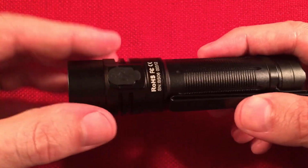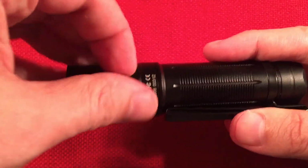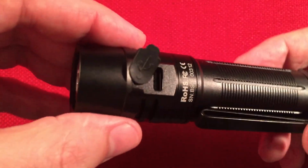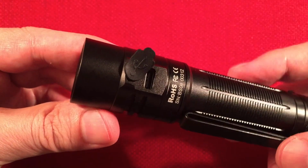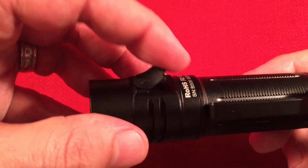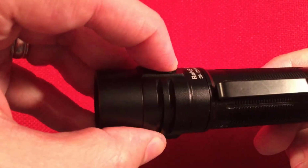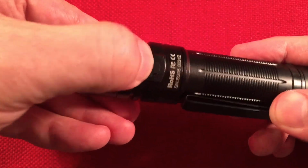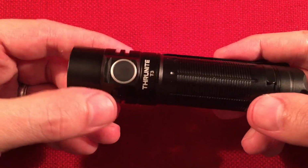Here on the back, we have the charging jack, the Type C. Go ahead and open this up here. All right, so when I hooked it up with the battery running almost dead, I got 5 volts, 2 amps. So it does a 2 amp charge rate, which is pretty good for a battery this large. So yeah, a real simple hookup there. And of course, they give you an extra jacket, which is nice. I guess that little jacket makes it IPX8 waterproof. So it can take a dunk in the water, but not for long. Yeah, they say, what's it, 2 meters for 30 minutes for IPX8.